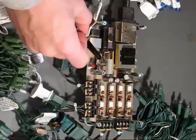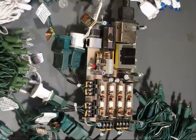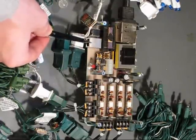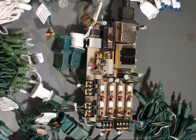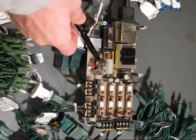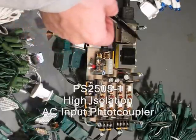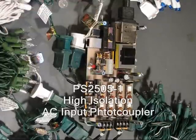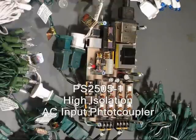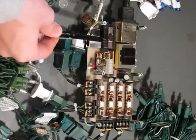I've got a MAX490 chip from Maxim Semiconductors for inter-board communication, wired up to an RJ45 socket for RS422 and RS485 interconnections. I've also got some debugging built in. I have a set of trigger sensors wired through drop-down resistors to the incoming AC power line in order to sense the zero crossing and the polarity of the AC waveform.